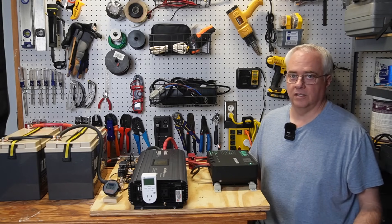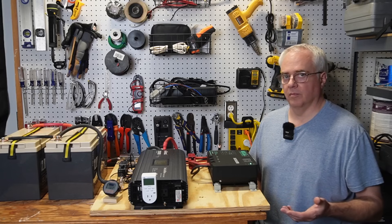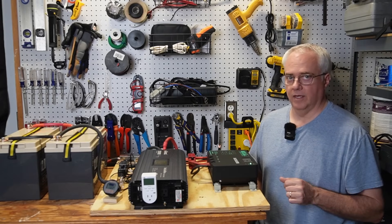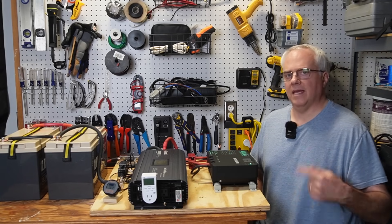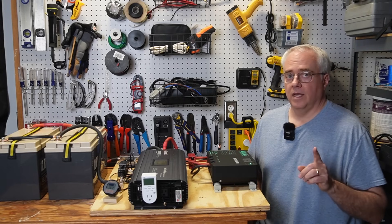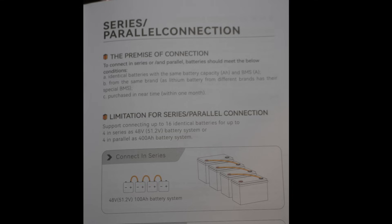That minimum assumes you have enough sun, and getting enough sun is just not realistic for most people. Where I live, sometimes we have several days in a row of heavy clouds and rain. On day four, I added the third panel and second battery — a total of 600 watts of solar and 200 amp hours of 12 volt batteries — which was enough to make it through several days in a row including one partly cloudy rainy day and one very cloudy day. It almost made it through two very cloudy days, but just wasn't enough to make it through the night. You just need to keep adding more solar panels and batteries until you can make it through enough consecutive cloudy days for the area you live in. As you add more batteries and solar panels, the way you connect them changes, so be sure to consult your equipment's owner's manual. For example, you can only connect four of those batteries in parallel, but you can go up to a 4S4P configuration of up to 16 batteries.